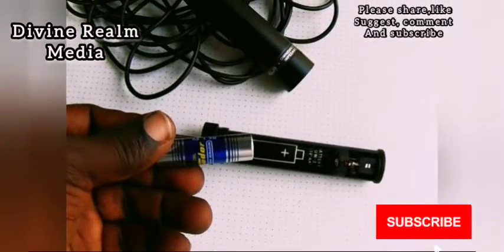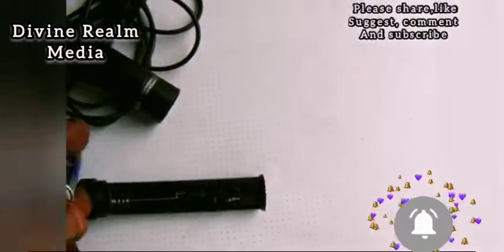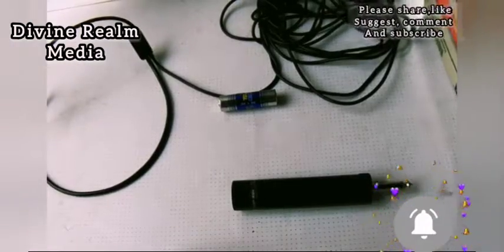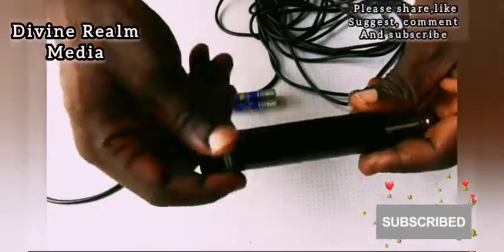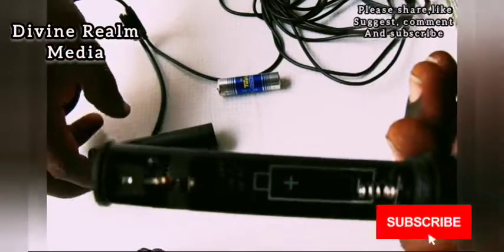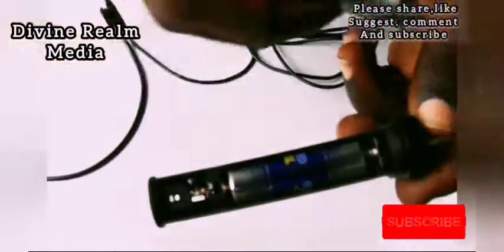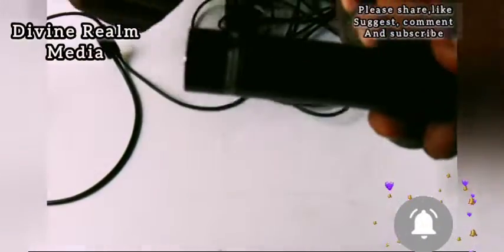There's also a battery, which I'll explain in a few minutes. This battery doesn't come with it, so whenever you're buying it make sure to get a battery. Take note: this is a condenser mic which requires some power before it will work. Without this battery inside the adapter, the mic cannot work, so you have to put the battery inside the adapter before it will power on.